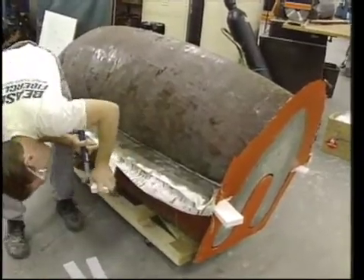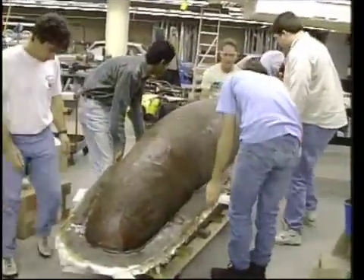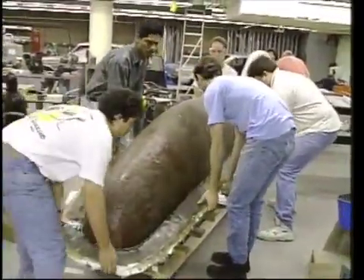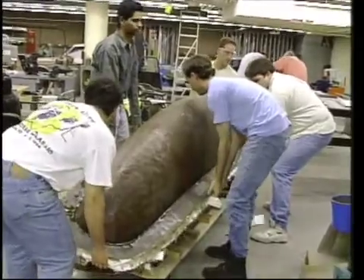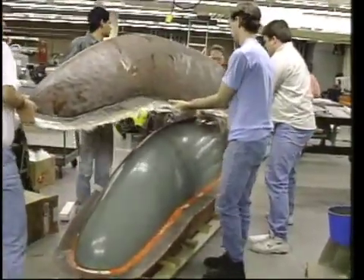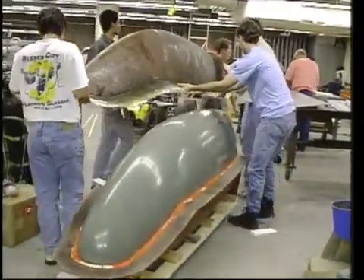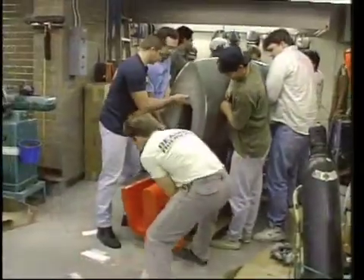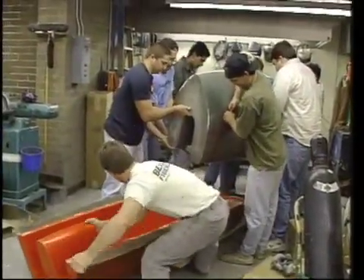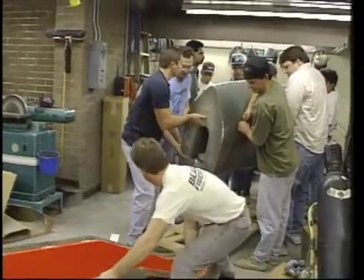Invariably, metal will gouge or crack the new mold. In this case, it was just a matter of inserting enough wedges around the perimeter until the mold broke free. The rear came up first, then the rest of the mold was lifted off the plug. The plug is still resting in the lower mold, but it obviously came through the molding process intact. It took many hands to lift the large waxed plug out of the lower mold; however, the two came apart easily because they had been released once before.